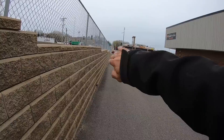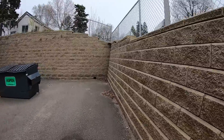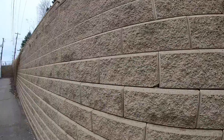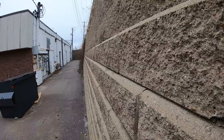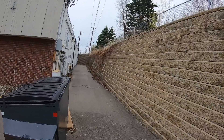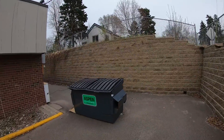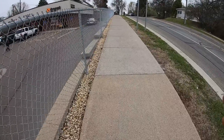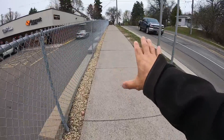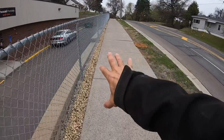The first indicators — the little signs, the separation, the leaning, the tilt — those are the signs like blowing up a balloon, and then that balloon pops: catastrophic failure, they rupture. You can actually see on this wall as you look down it — the top is starting to cantilever over. They couldn't get the grid in; they didn't have permission to cross the property line. So they were limited to that fence line. This wall is actually leaning, and you can see where the sidewalk has shifted right here — as the wall moves out, the sidewalk and everything follow suit.